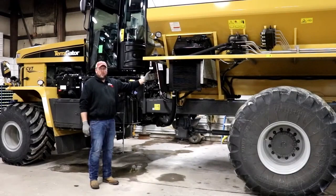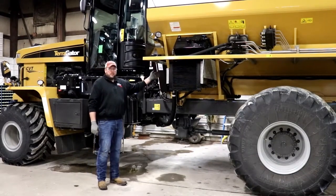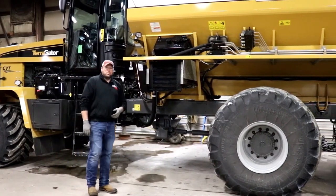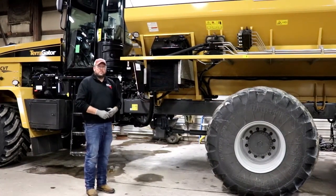As we move to the primary hydraulic tank and radiator assembly, we're again checking and making sure that all the fittings are tight and that there are no signs of leaks. You will also want to pay special attention to the in-tank hydraulic filter located on the top side of the tank. That needs to be serviced at a regular interval, which will be found in your owner's manual.